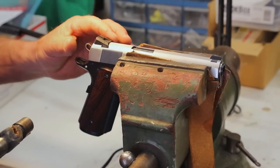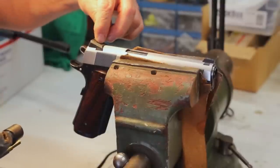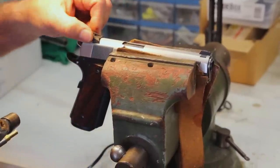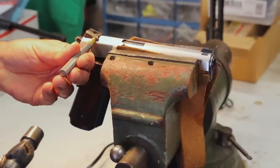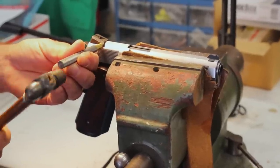Okay, we're going to move this rear sight. We've chucked it in a good strong vise and protected the jaws. There's also a set screw on this, and I've released the set screw — that is intended to hold the rear sight once you get it adjusted where you want it. Get a brass punch like this that won't really mar the sight. It'll leave a little bit of brass mark on the sight, but that's okay. Then you simply tap the sight over like this.